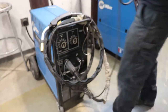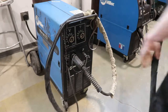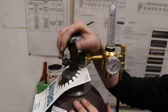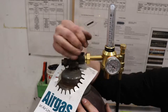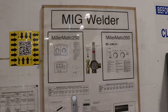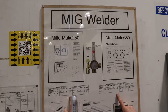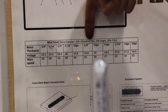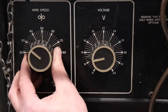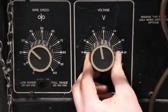We're going to set up a MIG welder for this. First, make sure your ground clamp is hooked up either to the part or to the table, and be nice with these welding leads — you don't want to kink them or wrestle them around too roughly as they can get bound up. We're going to ease open the argon CO2 cylinder and then open it all the way. It's a high pressure cylinder and you can see on the dial gauge that we have pressure. We have two different MIG welders and two different charts, so use whichever chart corresponds with your welder. We're on the 250 at the moment, going for eighth-inch material, which is the 11 gauge we're working with. Power on the welder and use the settings the chart says — it's a pretty good starting point. Make sure your machine is on full range and set your wire speed and voltage accordingly.